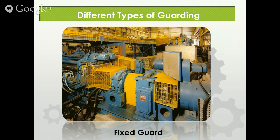If you're going to have a hinged guard, it's got to be able to be bolted or screwed down so it doesn't open. The point of having hinges: if you put hinges on a guard and fix one side, it's a lot less likely to get taken off and never put back on again. Because when maintenance is done, it's strapped to the machine — they just flip it over and put in the two screws to hold the other side down. Fixed guarding is my first choice when it comes to machines, but that always isn't possible.